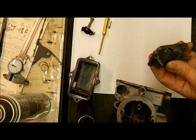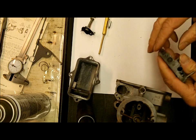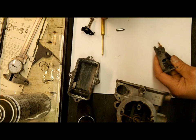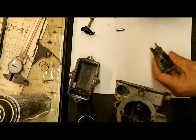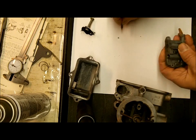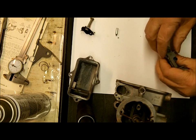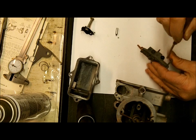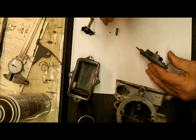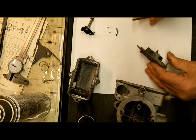I've got the metering block here which takes some special work — it looked pretty crusty. I took it apart because it's got a little check weight that goes into this hole and a little check ball that goes into this hole here. When I took it apart, the check weight had all kinds of junk around it and never would have sealed. I drilled these out — they've got little cups in them, like clean-out plugs — carefully, being sure not to make the hole bigger.